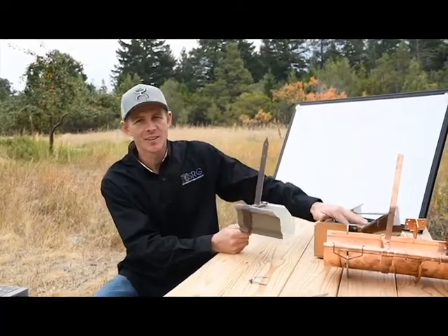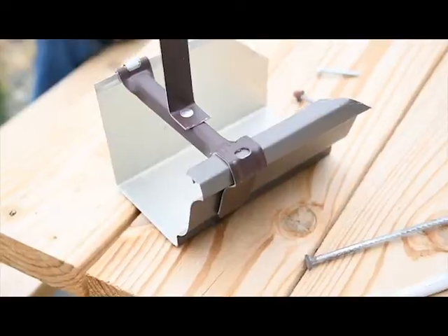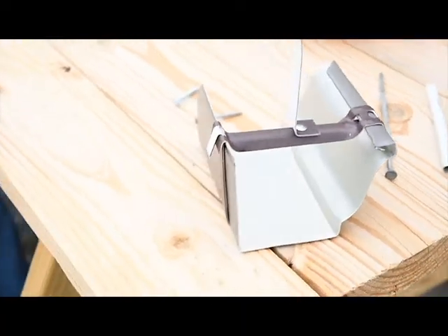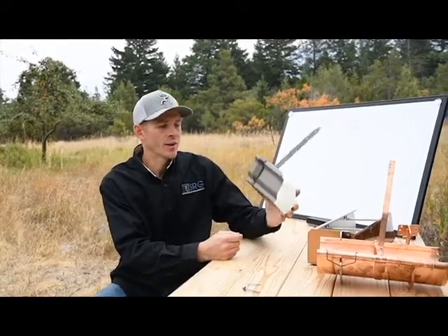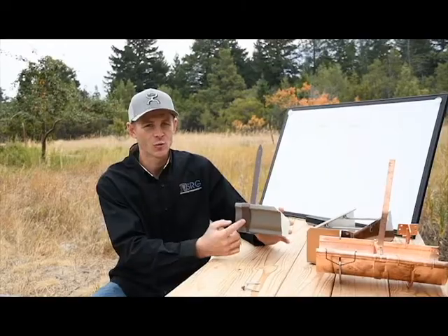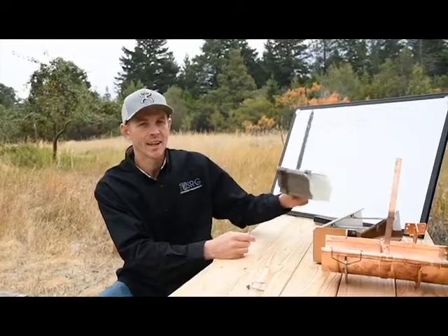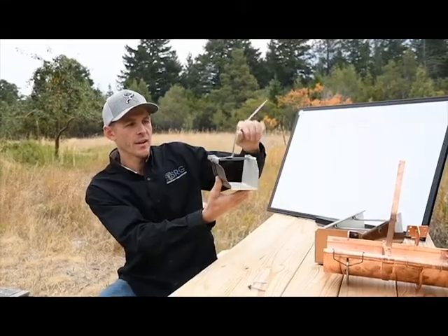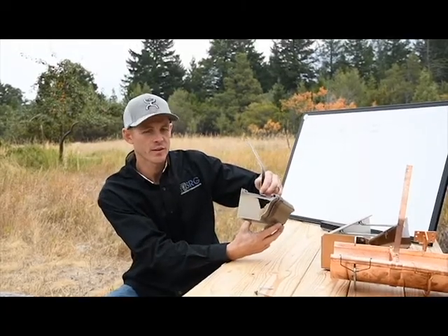When you can't get the simpler hangers to work, the next option is a full wrap-around hanger. This is for situations where the roof overhang is too long to get the gutter back to the fascia, or for strange fascia profiles. The downside is they only come in white and brown, so you have to paint them if you're using other colors. They don't look as clean as the hidden hanger, but they work pretty decently. These go up onto your roofing and can be installed every 20 inches or two feet.